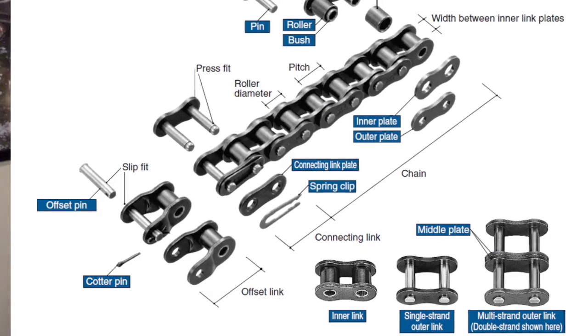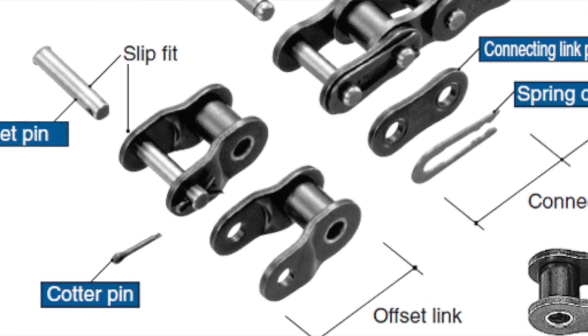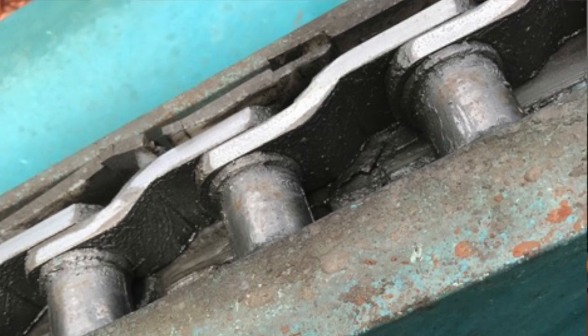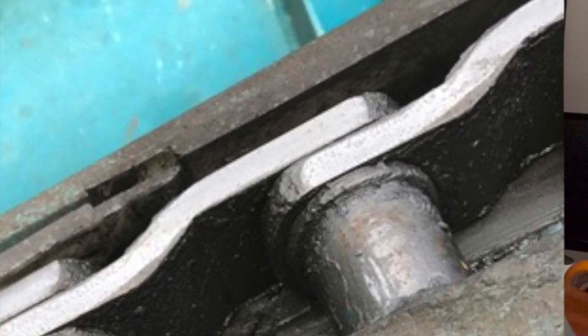When you talk about an S-link chain, S-link chains are quite unique because they have multiple characteristics. They wear more, but the actual steel itself, the bearing surfaces, don't actually wear much more than a straight link chain does. What happens is that S-link chains are typically used in applications where the train lands on the lift hill much harder. And those S-links all kind of give like this. That give turns the chain essentially into a giant rubber band. The chain's allowed to go whoop and then come back. So that's a very unique function.